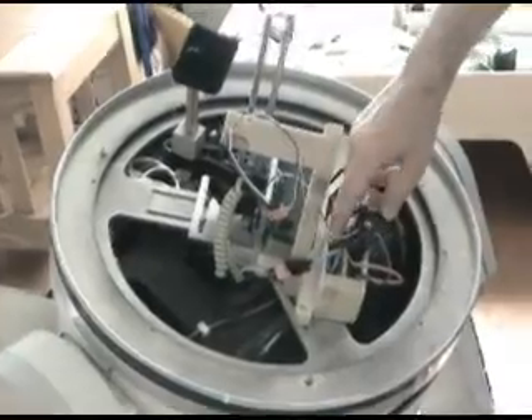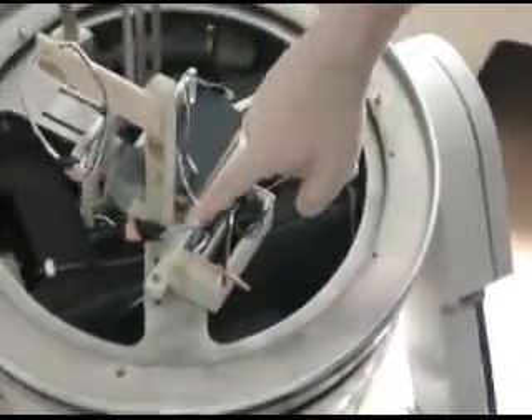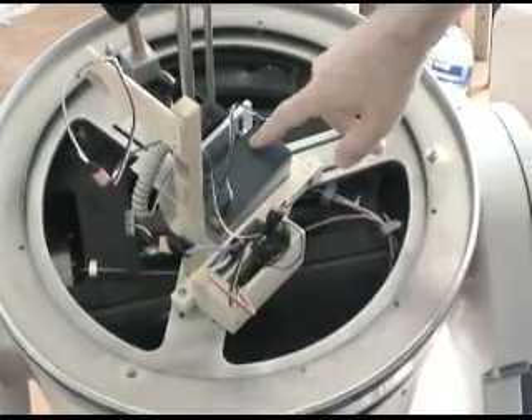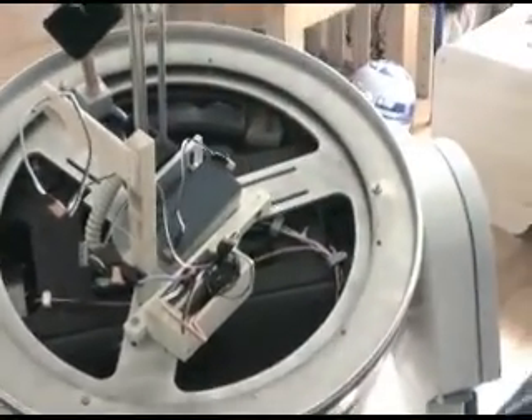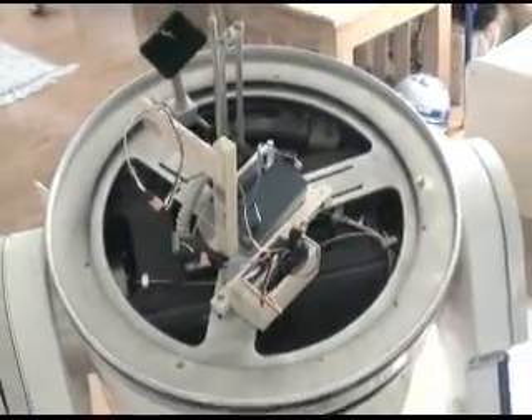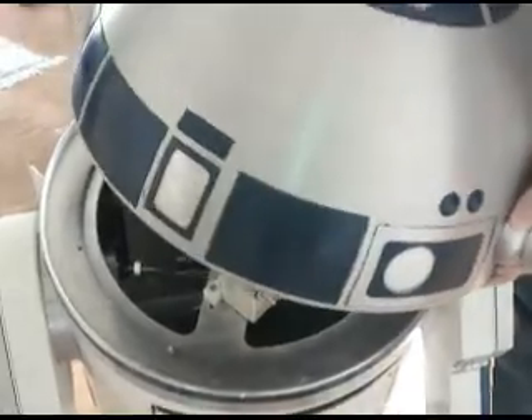You can see a separate receiver, separate power, separate speed control — this is to raise and lower the periscope and this is to light up the lights on the dome. It works very nicely, and because it has its own separate power and speed controller there are no wires going to the dome and nothing to risk twisting up.